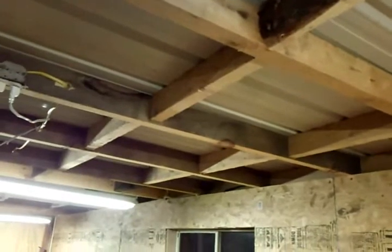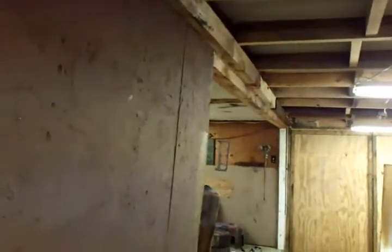I'll get up on the roof, where there are bolts with rubber washers on top by the heads, and put on a lock washer and nut and pull the tin tight to seal it. That part is a flat roof. This one here has about a 5-inch slope to it. It did leak twice when we got hard rain and wind. It blew back up underneath that tin and leaked down spider webs through here.